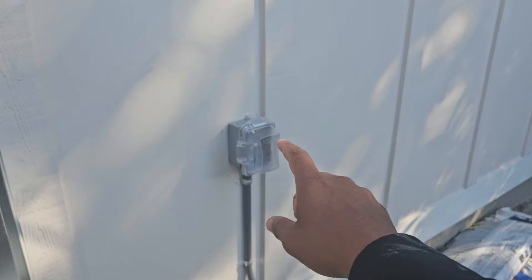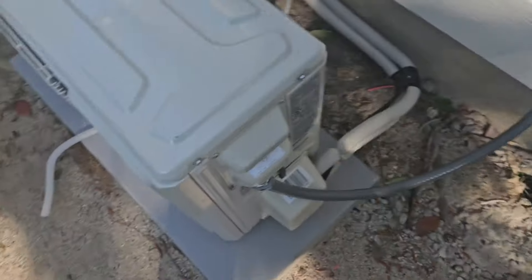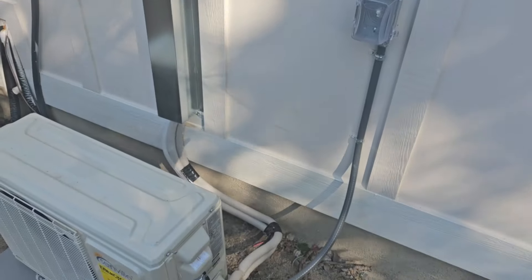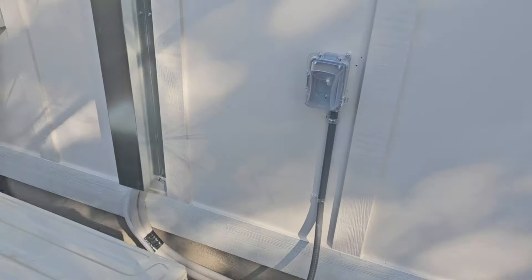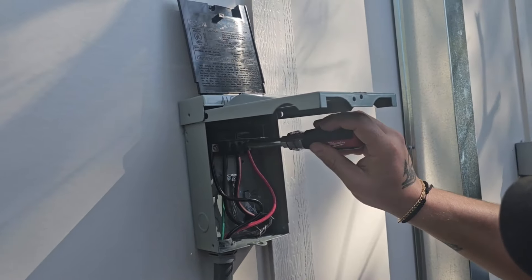The electricians switched my disconnect to just a regular switch. There was a disconnect here and they wired it up for 240V, but this mini split is a 115-volt system. If we wouldn't have caught that when we put the whip in initially — when there was a regular pull-out disconnect — it would have fried the unit. That was like a week or two ago. We came back today to put the filter in and the thermostat, and now the whole disconnect is just a regular switch.